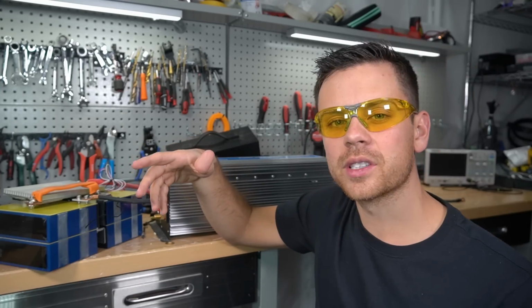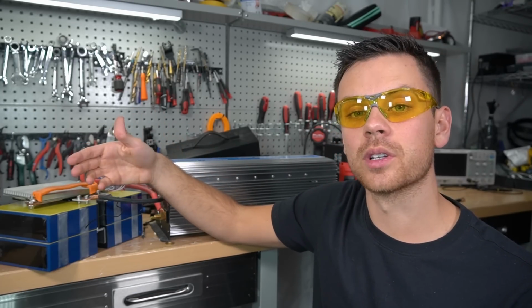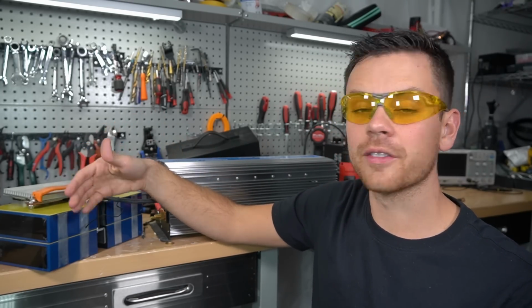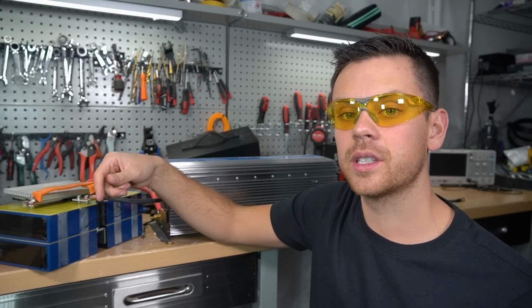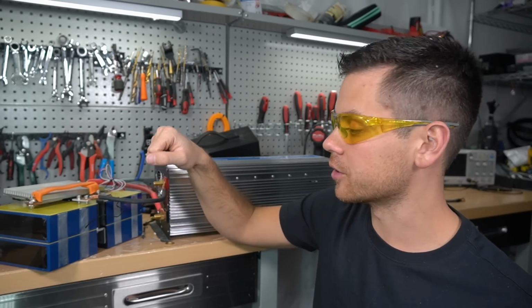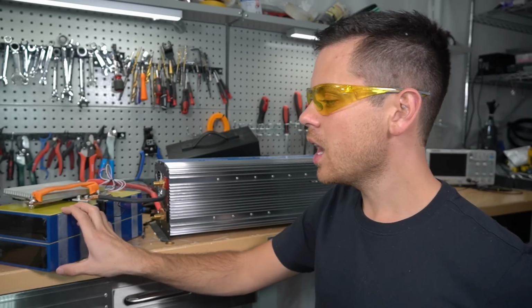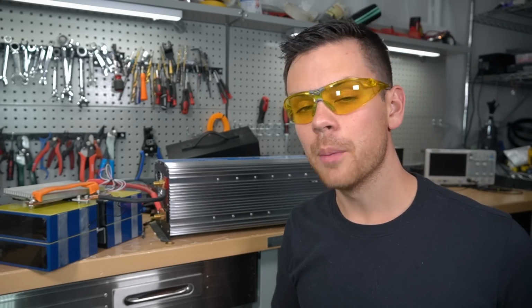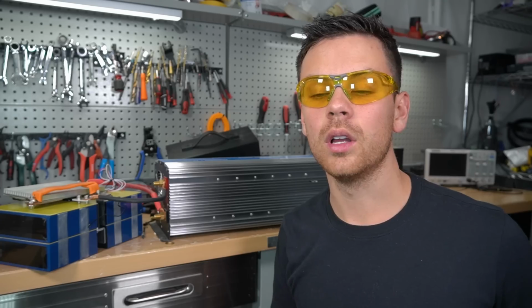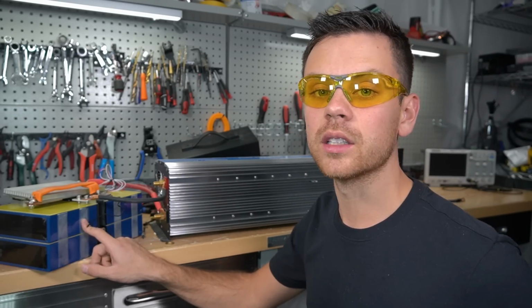And compare that for a second to SOK batteries. You can series connect those up to 48 volts. So in the future, if you want to build up to a 48 volt system, you cannot do it with these packs. I really need you guys to understand that. But this battery would be perfect for a 12 volt system that has to push large loads but still needs to be pretty small. So with RV and van dwellers, this might actually be a really good setup.